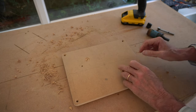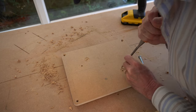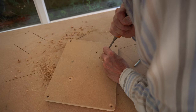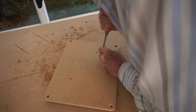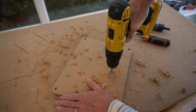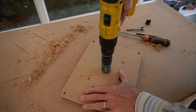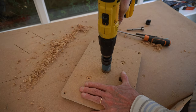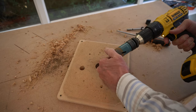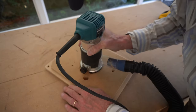This router comes with two bolts to mount accessories to the base plate, so I am going to use these bolts. To countersink the bolt heads within the MDF plate I'm using a 15 millimeter Forstner bit, which is the smallest one I have — ideally I could have done with a 12 millimeter instead. Once I drilled the 15 millimeter hole I opened up the hole through the MDF with a 6 millimeter drill bit. I needed to square out the first few millimeters of the hole because the bolt shank is square. I also needed to ensure the bolt heads were firmly below the face of the insert. Another 15 millimeter hole was drilled straight through for the winding handle, and finally a 30 millimeter hole was drilled through for the router cutter. The winding handle hole and the router bit hole were just cleaned up with a chamfer cutter in my Makita router.